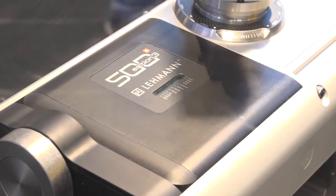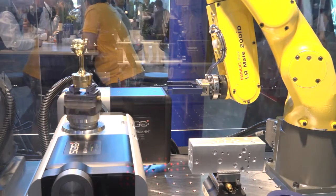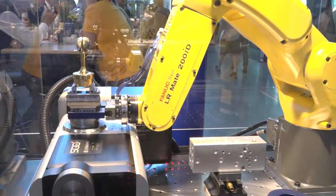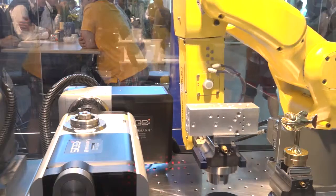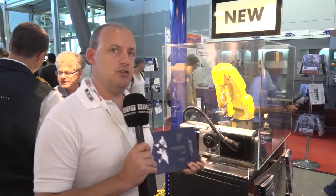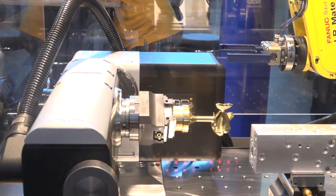They're very nimble, they're very quick, there's zero backlash on these, and they've got a very high clamping force of 2,000 newton meters. It's a brand new model but also very low cost. So if you're looking at expanding your machining center to do more complex components, adding this two-axis table might be the right solution for you. It's available from Avon CNC Machine Tools in the UK.